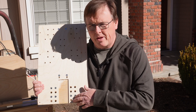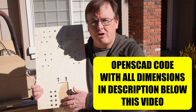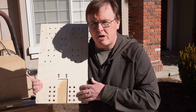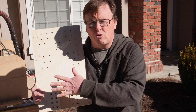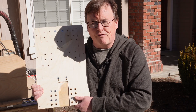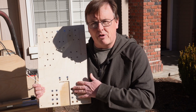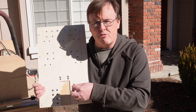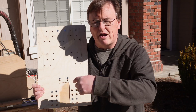Here's the secret to the new design. You're going to do an inset in the actual board that you're directly mounting your rails on, and instead of using the metal router plate, we're going to fix the motor directly down. We'll put threaded inserts on either side, put a board on top, and anchor it with quarter-inch screws — I'm using three-inch quarter-inch screws, but three and a half inch would be a better choice. On plywood, use a three-eighths-inch brad point drill bit and thread the inserts right in.